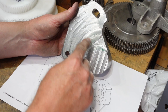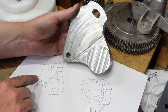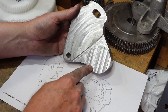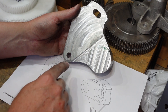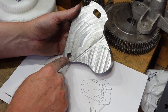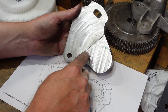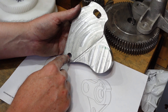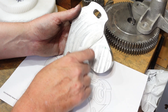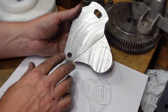Once again I still have to bore out a couple of holes, but that's quite all right — I can use the boring head for that on the table. However, there is a scallop here, and that's actually a relief for what I think is a pulley in the lathe, so I need to set that up. I've got dimensions from the centre of that hole and so on. What I'm going to do is put a bit of masking tape on there, locate that hole, and then use that on the rotary table to swing that arc and just cut that bit of stuff away. Then all I need to do is bore some holes and that'll be this one finished.